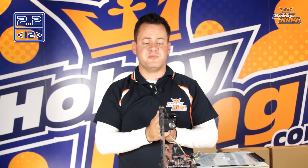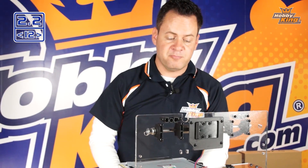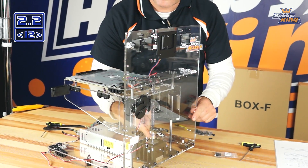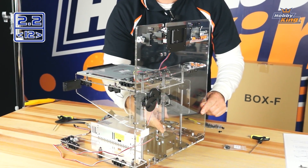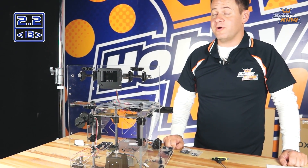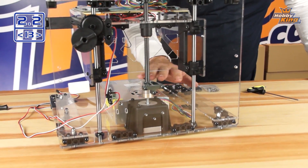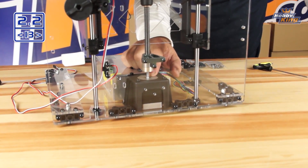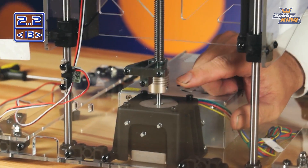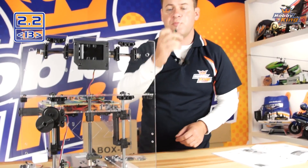And there we go — that is our first tramming procedure. All these rods are aligned to each other with the bearings in this direction as well as in this direction. We can verify it helped by going back to that initial test — the amount of torque and drag to rotate this collar — and yeah, definitely I can now rotate this with just one finger. There's very, very minimal drag on the shaft itself. Super smooth. That brings us to step 2.2.13, which involves the little collar down here. We raised it up tight against the lower mount, but now that everything has been trammed, we need to loosen it, slide it down, and engage it into the motor. The distance between top and bottom isn't critical — just eyeball and split the difference. No need to measure.